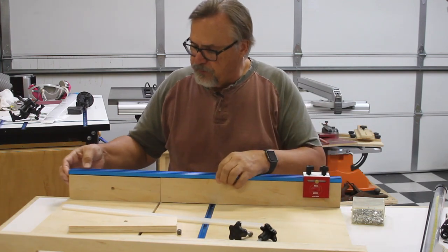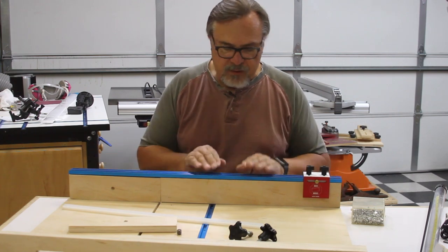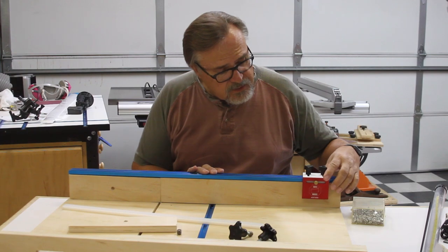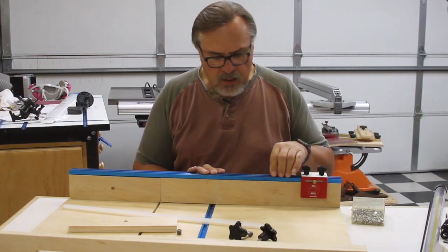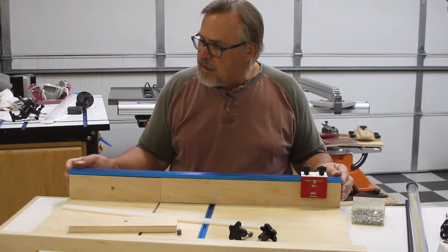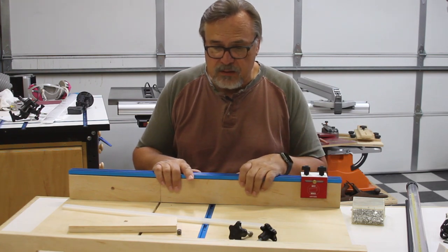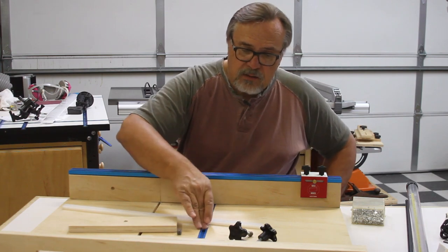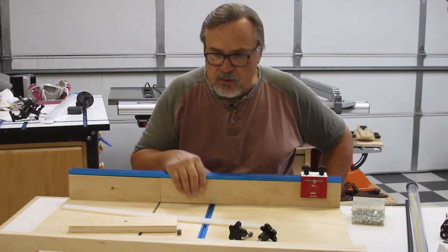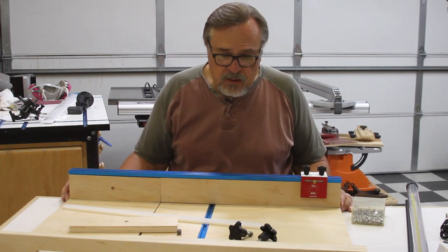These pieces are going to take an inset screw, and the handles go on the outside to make the adjustments. I have this track I got from Rockler — you make a groove, screw it in, and the track fits on top. I also got a stop block from Katz-Moses, which I'm trying out. I think I have another one from Rockler that fits this track. I also have a ruler I can put on here but I'm not sure I'll use it yet. I also wanted to put a track in here so I could have a hold-down for the pieces I'm going to cut.